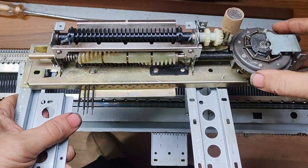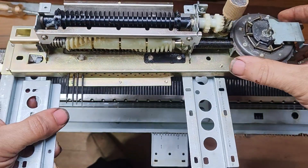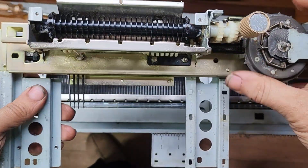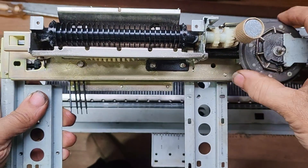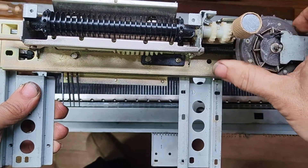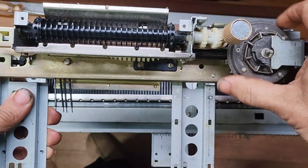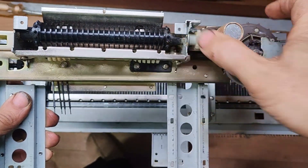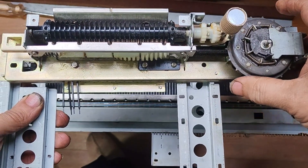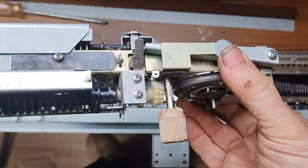The first thing to say is: don't take card readers off machines unless you know what you're doing, because they're the very devil to get back on again. This is the card reader. It holds the card, and there is a little mechanism here that every time I change direction, it moves the card on by one. Every time I go anti-clockwise, it moves it on by one; when I go clockwise, it moves it on by one. That is the act of changing direction on the carriage. The carriage drives this wheel via a belt, which we'll look at later.